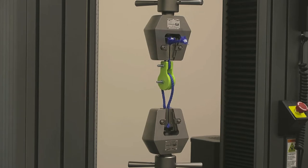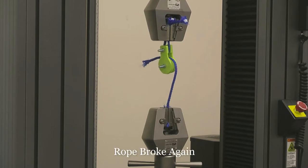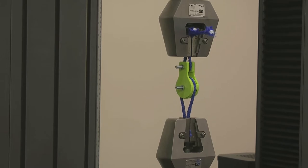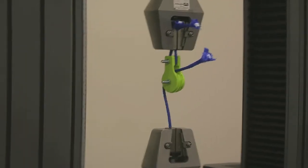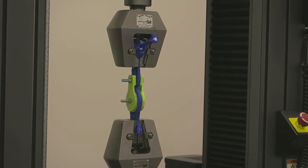Okay, we set it back up. We're going to test again and see if the rope breaks — I'll have to double it up or do something if it gets past that 835 mark. That's three times now. If the rope breaks again we'll double it up so the rope is not the weak point. We've now put two ropes in there because the last rope broke at an average of about 800 pounds. So we're thinking if it manages to break both ropes without breaking the pulley, or crosses a thousand pounds, we're just going to give it the gold star — because the worst one I thought would perform has now held 800 pounds.